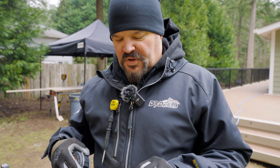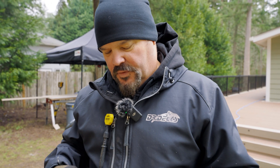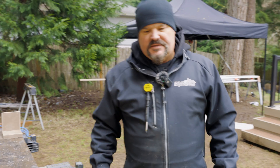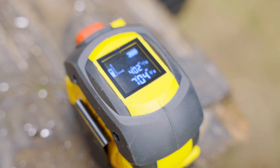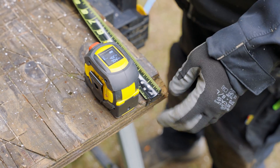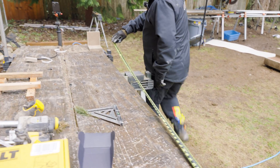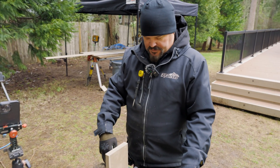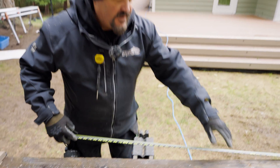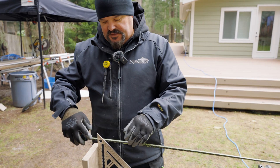We're off about — more than a quarter inch. We're out seven sixteenths. Let's try again and move it a little further away. We'll move it way down here and see what the tape says: seven foot four and three eighths. So I'm going to hook my tape right here. Seven foot four and three eighths — and I've got seven foot four and three sixteenths. The laser is not accurate at short distances. Let's go back and try within 12 inches.